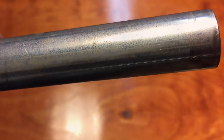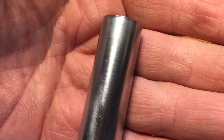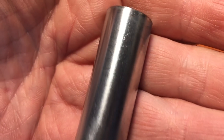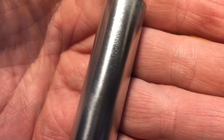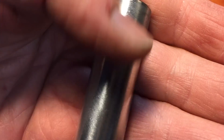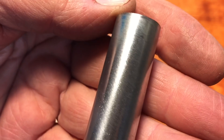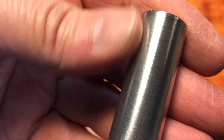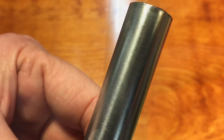We took this little piece of conduit pipe over to the wire brush, and you can see the surface we left. There are some small scratches in there — those small scratches left from the wire brush are typically what we have in a lot of tools after we remove the rust. So now what we want to do is get this out by going with a finer abrasive than those scratches. So you say, let me try a 320 grit and see what that does, and I'll do that with a little sandpaper.